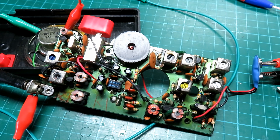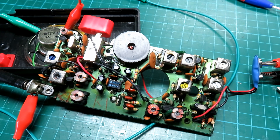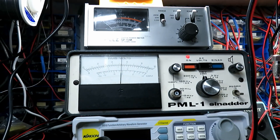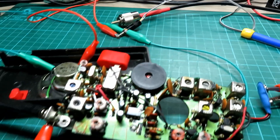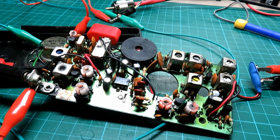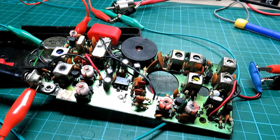Radio A is done. I think Radio B is going to have more problems — I think it transmits but I don't think it's receiving. There's just a bad connection there. Right off the bat we're getting 105 microvolts for 12 dB SINAD — about as poor as the other one. We'll work on the receive side and see if we can bring it up. We've brought it up to 85 microvolts for 12 dB, so we've improved it a little bit. It's receiving exactly the same as the other radio — both absolutely deaf as a post, but out in the field they won't be so bad.